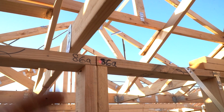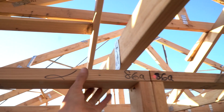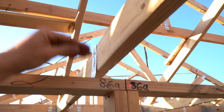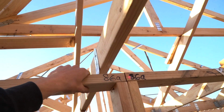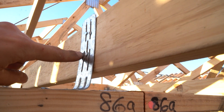As soon as we have any fixings attaching the wall and the roof together, it's going to turn this into a load bearing wall. Once this roof gets loaded with its weight, the roof is expected to sag down a little bit, and what it'll do is make a bit of a squeak in those nails and in that block. That's exactly why we put these nails in the L brackets in the middle of these slots.